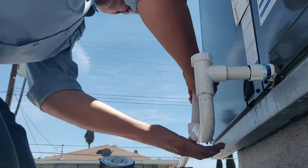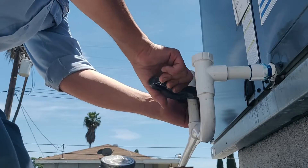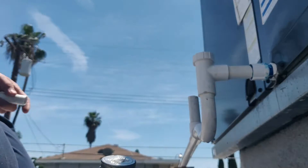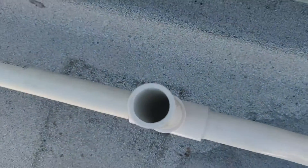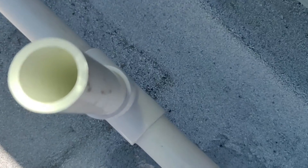So now I'm installing the vent for the drain. This vent has to be at the same level as the top of the drain pan of the evaporator coil inside the unit. Now I slide some two-by-fours of treated lumber underneath the drain line, and then I wait to see if it's going to drain — which it does — but I have to confirm it.